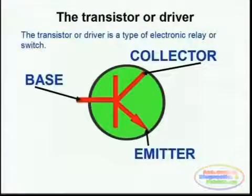Those three leads are actually interconnected within the circuit, usually inside a computer or module, and it is actually how the different loads are tested. By applying a small pulse at the base, you complete the circuit between emitter and collector, and this is how transistors trigger the load.